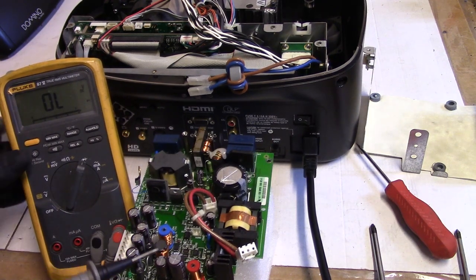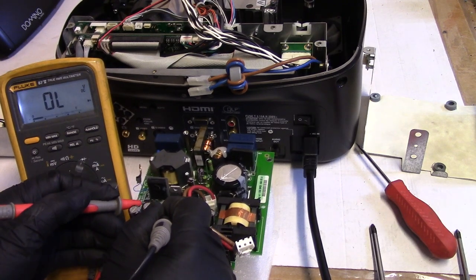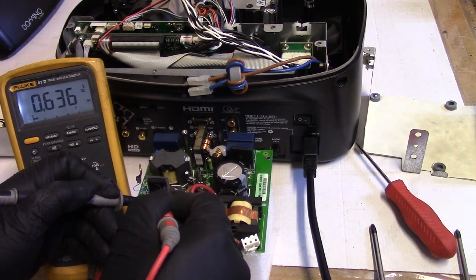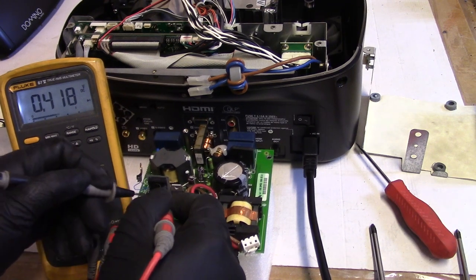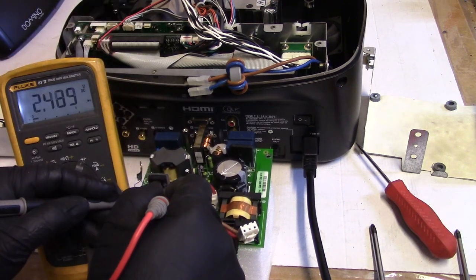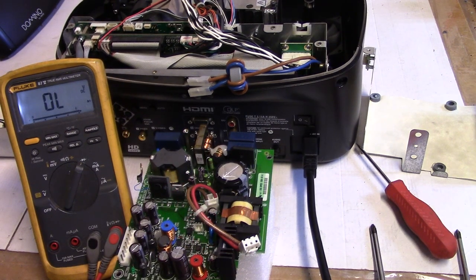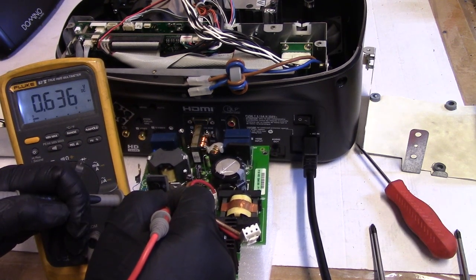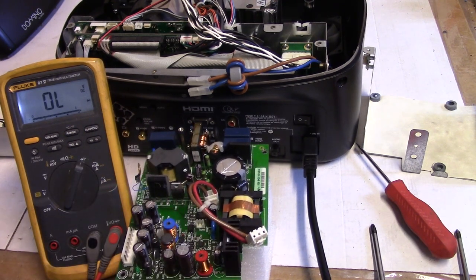Let's just do a quick short circuit test. I don't expect it to be shorted in any way, shape, or form. 1.12, 1 volt, 0.6 volts. So that's the protection diode. But I wonder why I'm getting that. I don't think I should have anything from gate. The source from drain to source, one way we should have that, that's the blocking diode.